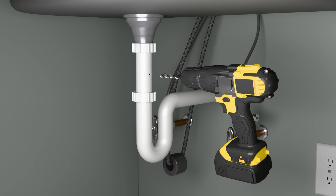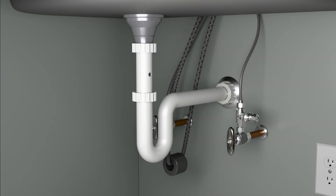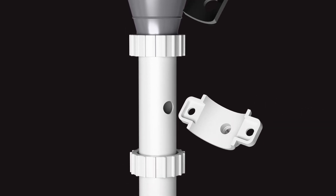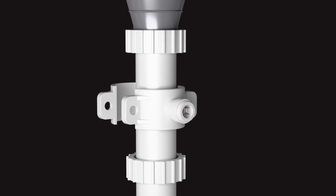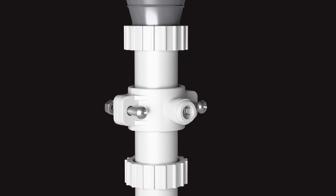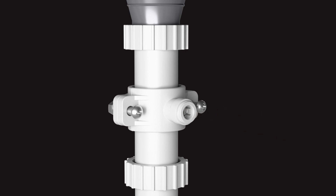With the hole drilled, you can now install the drain saddle. Begin by using the included gasket which has an adhesive backing on one side. Peel off the protective backing to expose the adhesive and ensure the adhesive side is facing the drain saddle and is perfectly centered over the hole, then press it down firmly into place. Place the drain saddle over the drilled hole and secure it in place with the included nuts and bolts. To ensure proper alignment, insert a pencil or small Phillips head screwdriver through the side of the drain saddle until it enters the previously drilled hole. This confirms the correct alignment between the drain saddle and the main drain. Once properly aligned, continue tightening the bolts on each side until snug. Ensure the connection is watertight without overtightening.